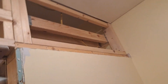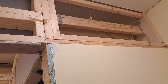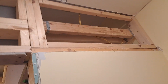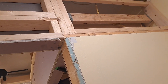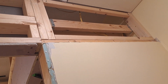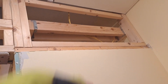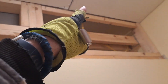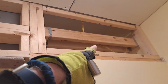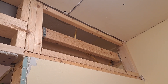That's the update — just waiting for my staples, which should be tomorrow. I'm going to work on this other piece up here, I've got to get my measurements and I've got all my nailers in. Actually, I may need a nailer in there too — maybe a two-by laid flat ways. A nailer up and down would do the trick. I'll put a short little one-by in there. A little bit more work to do, but that's fine. Stay tuned, more to come.